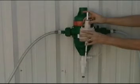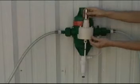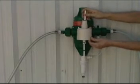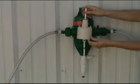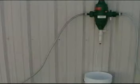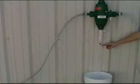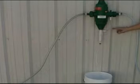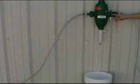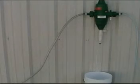Water flowing through the water motor section drives the motor piston that is mechanically connected to the chemical pump by the motor pump connector stem, creating a positive displacement. As water is flowing, chemical is then drawn up from the chemical container by the chemical pump, bypasses around the water motor section through the pressure tube, and mixes with the water in the large 2-inch pipe mixing chamber at the outlet of the water motor.